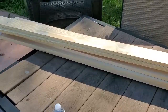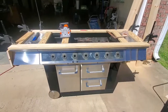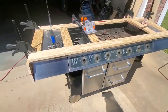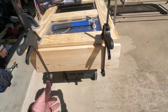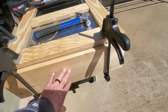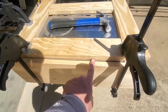Got some lumber here, and there's my granite. I bought the wood, took my measurements from end to end, front to back, and cut some wood. I'm going to frame in the top of it. I've cut some one-by-eights so those will come up even — that's what the granite will sit on. It's going to be boxed all the way around. I'm going to stain this espresso and then put a water-based polyurethane, which expands and contracts with the sun a little better.